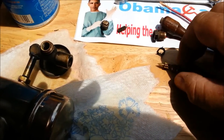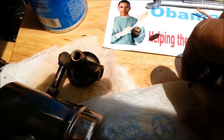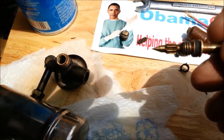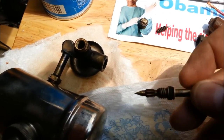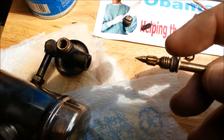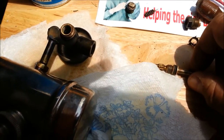It's probably left over from this packing material wearing. Now this little packing washer here — when you tighten up the packing nut, these two copper washers are squeezed together and the diameter of this piece is increased as it squeezes against the shaft and against the internal bore of this part. That's probably a piece of leather, and if I can't get it to seal good then I can make another one out of leather and put it back together. But I think this part is satisfactory enough to reuse, so I'm going to put it back together with that.